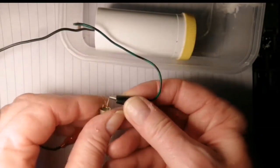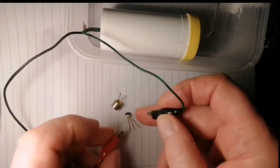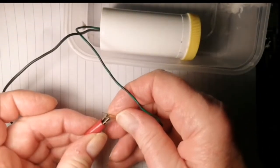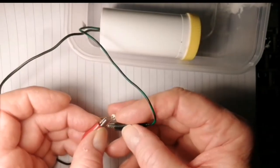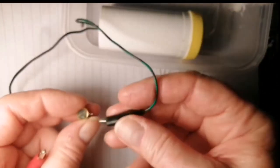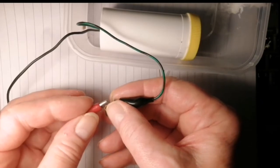And we can also say this is germanium, because bringing the other one back, if you listen to the sound that this one makes, it's very difficult doing this through the camera. You lose all sense of depth. Notice that junction sounds low pitched, but this junction, remember that pitch? Higher pitch, less forward voltage drop.